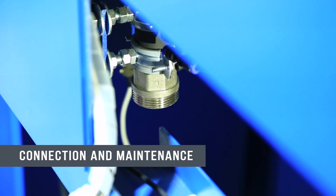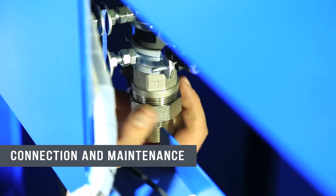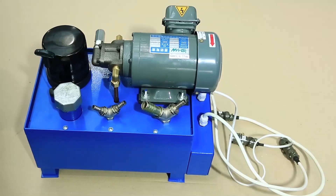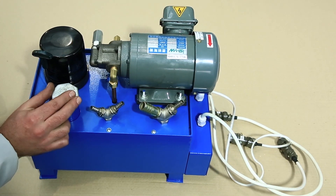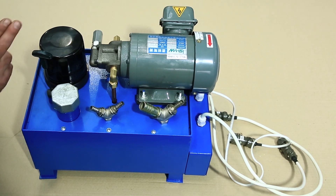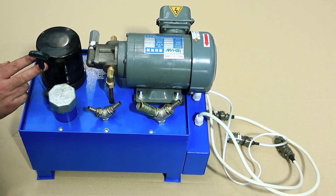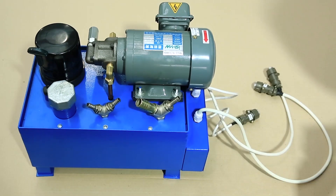Connection to the air machine is carried out by a cap nut included in the kit. The section of the air connection pipeline must match the fitting. The oil station included in the kit has a volume of no more than 10 liters. It has a nozzle for draining oil and for supplying oil, a fill neck, a fine filter, and also inside is a coarse mesh filter and the pump itself. I recommend pouring 10W40 oil into the oil station and changing it at least once a year.